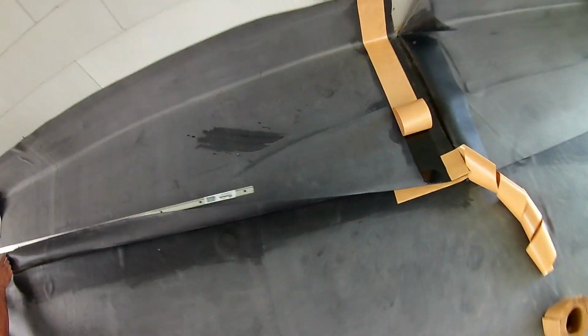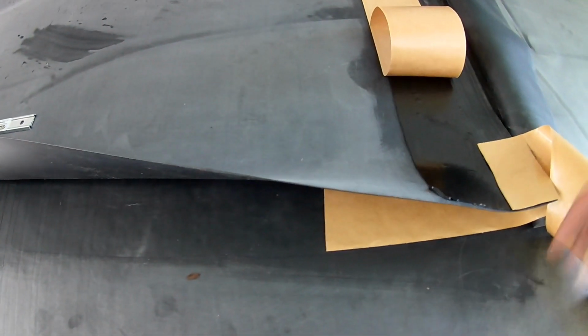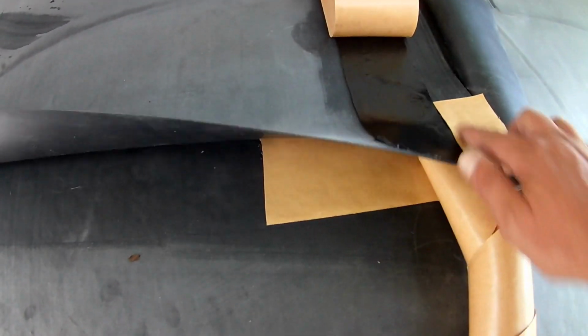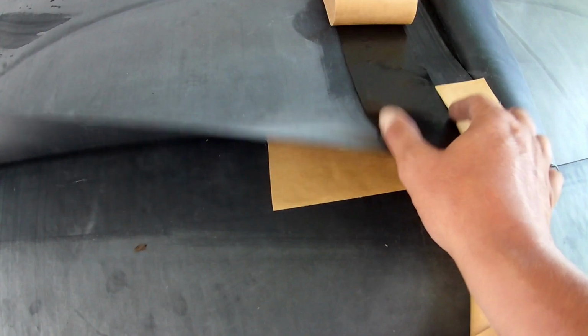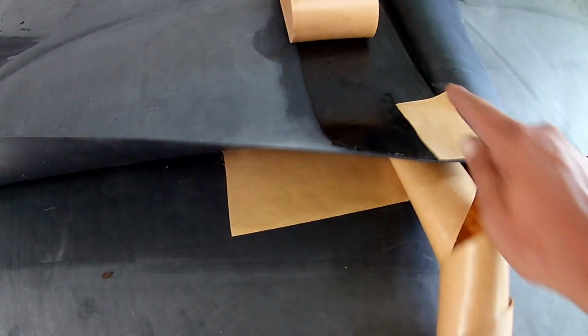And the seam tape is just a double-sided sticky tape, but this stuff doesn't really work unless you do these other steps. And then in spots like this where you have seams on seams, verticals and horizontals, you got to make sure your lap is the perfect width, or you're going to have to add a little bit. If I don't add this little piece right here, it's going to allow water to run up and back, like in an ice dam situation.